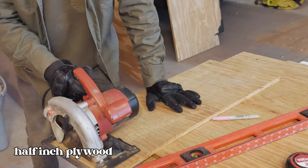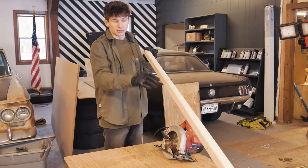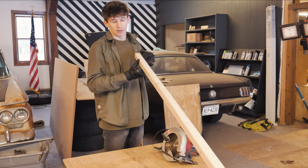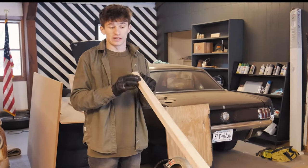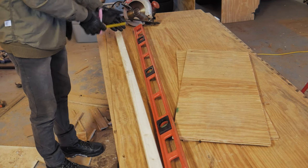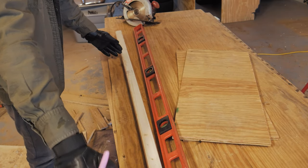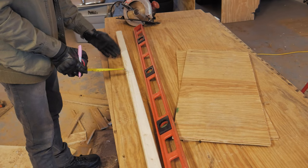This is what we're going to cut the actual angle of the shower — the slope into it to make sure the water actually drains. I'm going to try to get it so it's one fourth of an inch for every foot. Right here is where the shower head and the faucet will be, and then there'll be a slope here, a drain — this will be the lowest point. Then this entire thing here will slope down to the one foot mark.